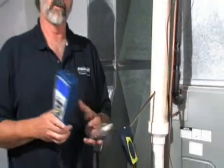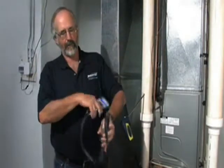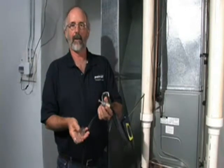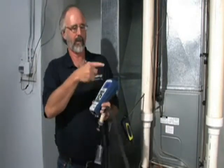On this particular piece of equipment, we drill a hole in the PVC pipe and insert the probe into that hole. Check with the manufacturer of the equipment you're servicing — whether it's oil-fired, gas-fired, a condensing unit, an old atmospheric piece of equipment, or an 80 percenter — to determine what readings you should see in the display. Also make sure that the moisture trap is always below the level of the instrument; if it gets too high, you could end up sucking water into it. At the end of each job, if you see moisture accumulated inside the moisture trap, open it up and empty it out. If it's the end of the day, leave it open to let the filter dry out thoroughly. At the end of each job, unplug the hose and probe assembly and let the instrument run for another five minutes or so to dry things out inside.